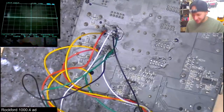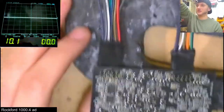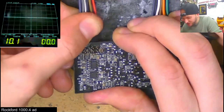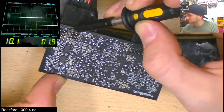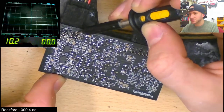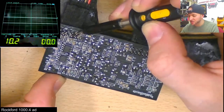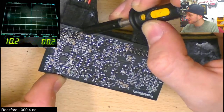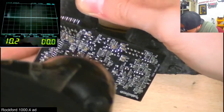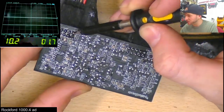So I decided to just refit my original headers and swap the cards over between the headers, noting down the voltages at different points in a notepad for each card. The first comparisons between the good and bad daughter boards were between some of the output pins we hadn't checked yet. It was over here that I noticed some differences in voltages between these two cards. On this card, this one gives me 9.6 volts — we should have 9.5 to 9.7 volts, which is not present on the bad card.